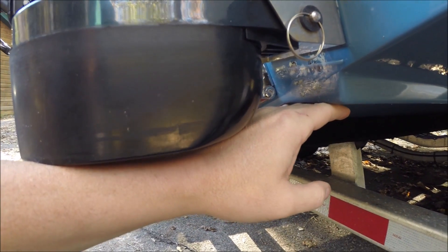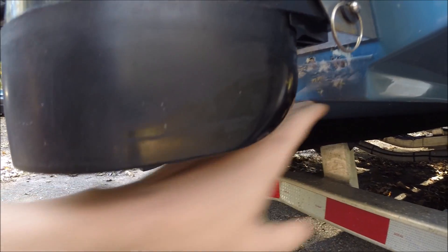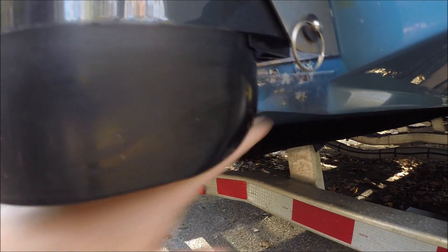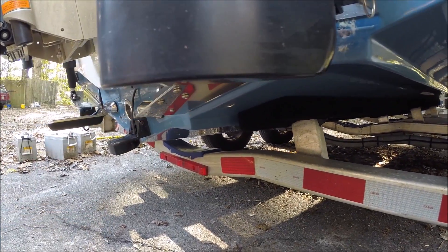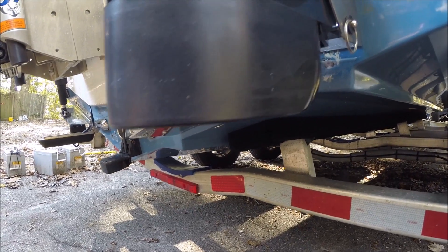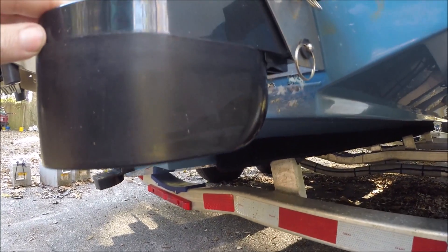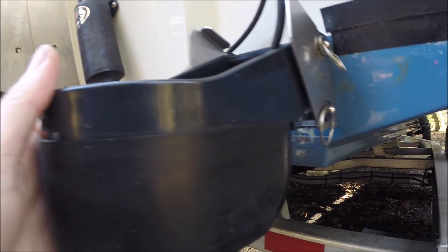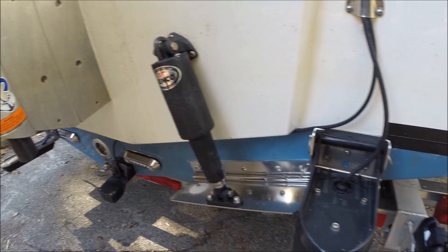And again I know it's too low — a lot of people can look at this and say you're crazy going that low, they're not designed that way, they're supposed to skim. But again I'm asking a little bit more out of my transducers. So you can see it's completely below the hull here. There is no wedge in here — this transducer comes with two, but the following edge is already low enough without a wedge. Start with this and if you're getting air or not marking the fish you want, you can lower it a touch, relocate it, or move it closer to the keel. This does throw up a rooster tail — it'll come kicking up and you can see it behind me, but it doesn't bother me.